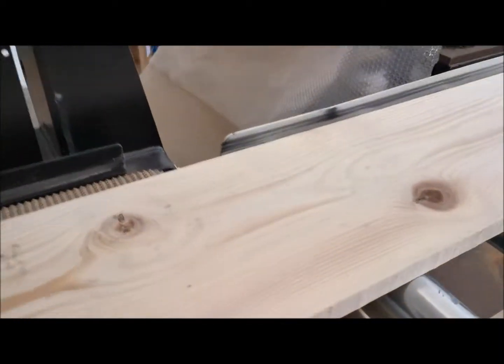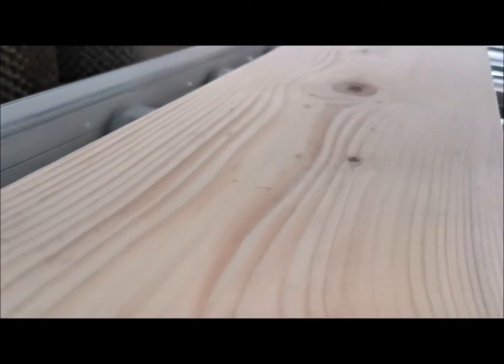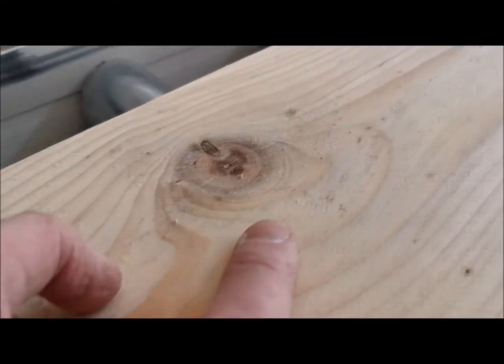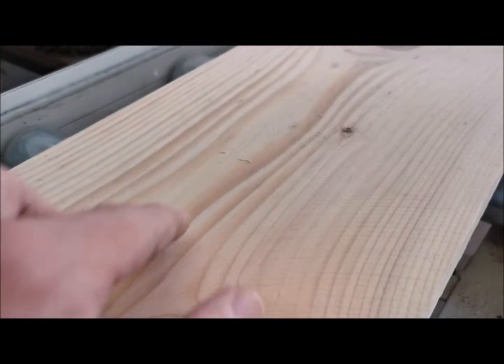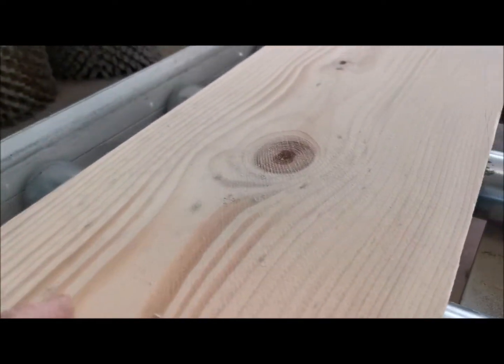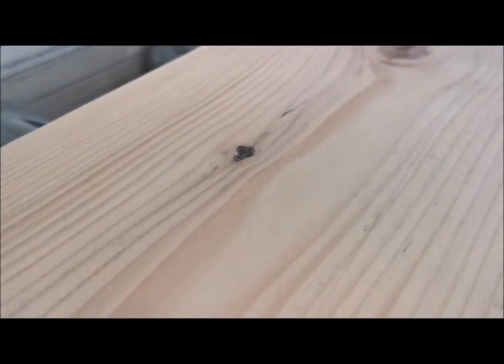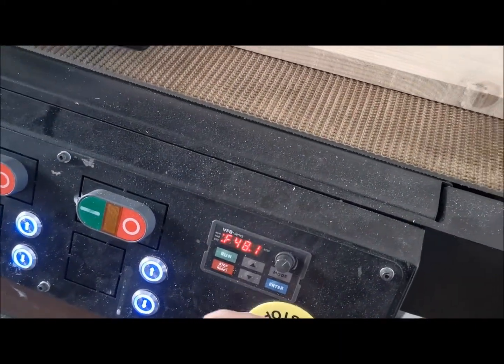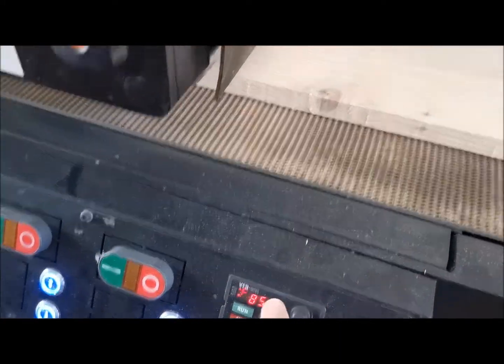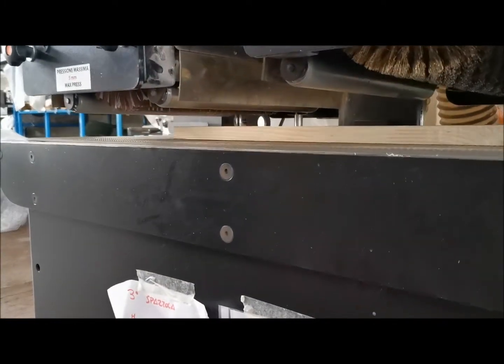Only this brush. Now we have this lamellar drum, and we will use it to smooth that rough, flat surface. You see, it's dirty and full of little pieces of wood like this, so we will pass both sides to clean it perfectly. So, first of all, we act with the traction speed at the top speed, and we will set the drum.